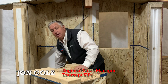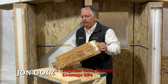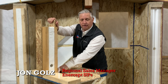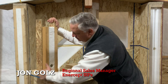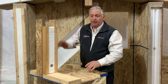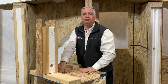Your Intercept panel comes from the factory with the bottom recessed, ready to receive that sill plate. So you set the panel in place. Now you nail the inside — your 2x6s to your 2x6 — and you nail the outside. And you see how this OSB flushes right out with the edge of your foundation or your subfloor. You just keep continuing like that, and it's a really strong hold of your framing down to your subfloor.